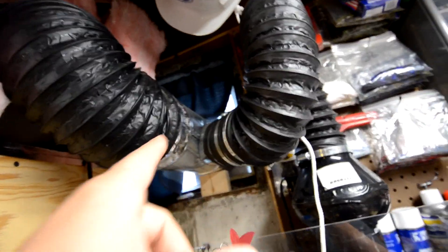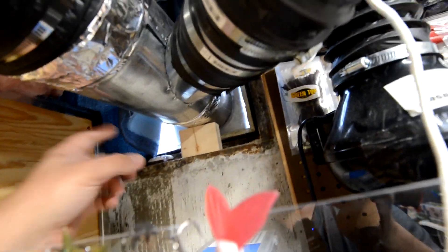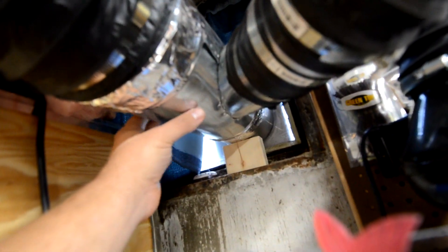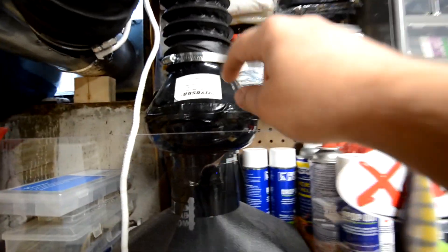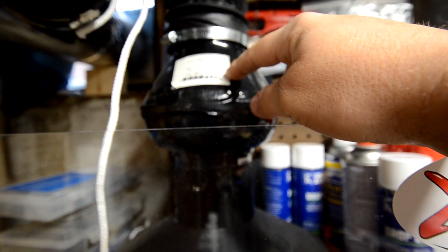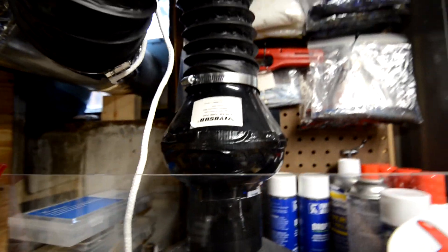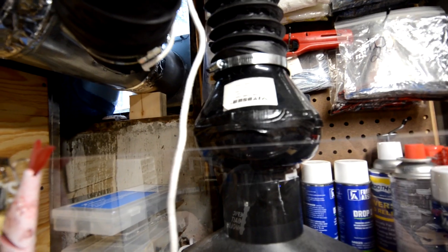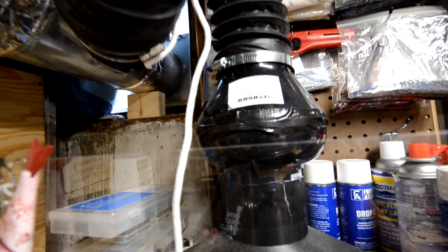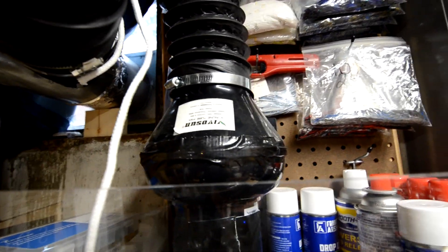The air goes into that tube at an angle and goes right outside. There's a bigger six-inch tube out there, but for what you need if you're just doing lead, a four-inch is plenty of air movement. This fan is also 2,500 RPM, and the CFM on that fan is 195 CFM — plenty of airflow to get it out of the house.